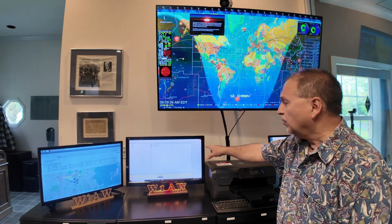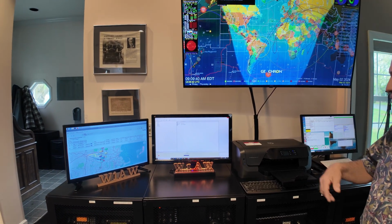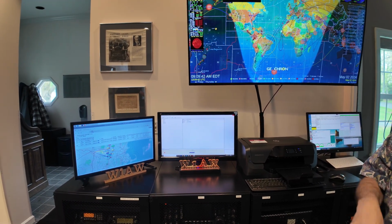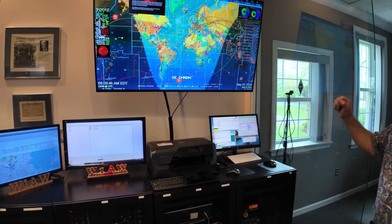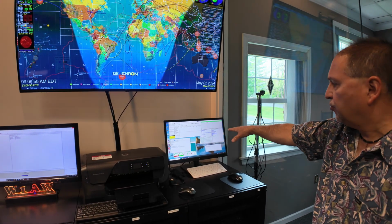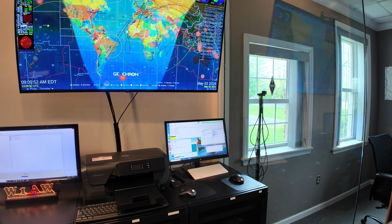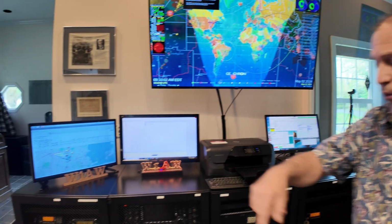Wow. We have Echolink. We do run an Echolink conference server that amateur operators can connect to, and they can monitor our transmissions in real time. We also are a WinLink station. We have HF and VHF WinLink, and you can see some of the control that we're doing here. We have a system running locally on 2 meters, and that allows individuals within the area to connect to it for WinLink traffic. And we have D-Star on 23 centimeters.